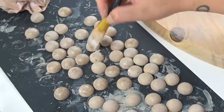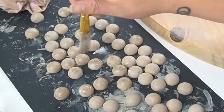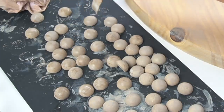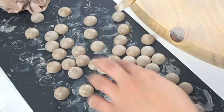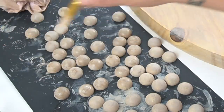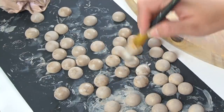For the beads, I wanted to give them a little more dimension, so after these dried I added a little more antiquing wax throughout them to give them more of a wood grain finish. They looked a little solid after I added the stain since they were a different wood than the board, but the antiquing wax actually gave it a little more dimension. These don't have to be perfect by any means because later on I'm going to dry brush them white.